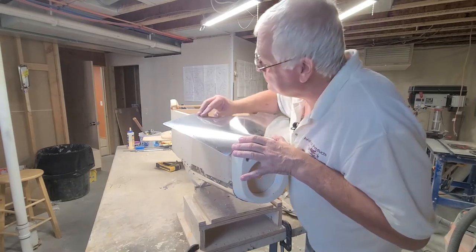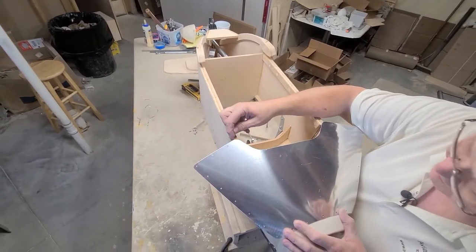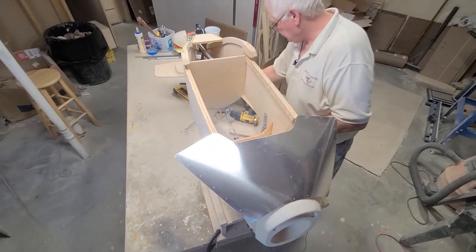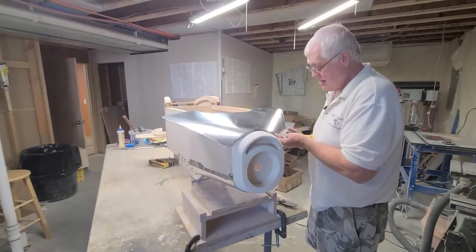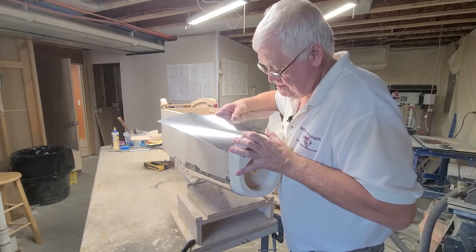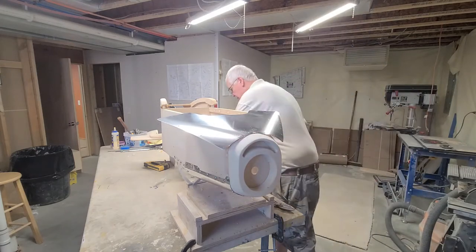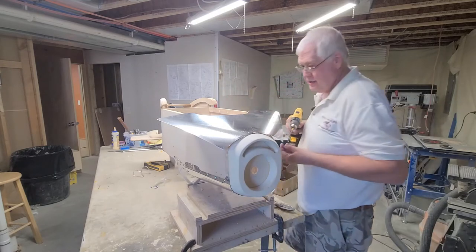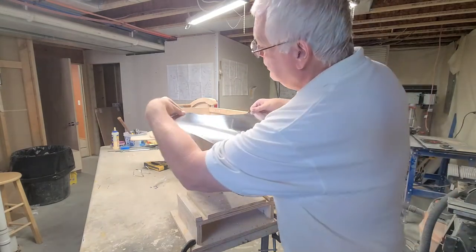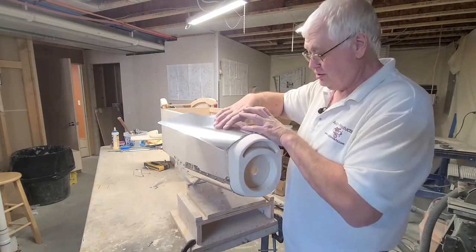And how I align this, where this bend or this radius starts right here, I want it on the outside of my fuselage on both sides. That's where I want it, right there. You're going to keep watching this and holding it square, and you're going to walk this around like we've done on everything else. Work out from center, one hole at a time.